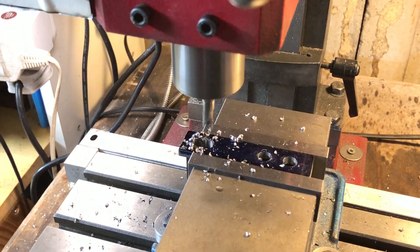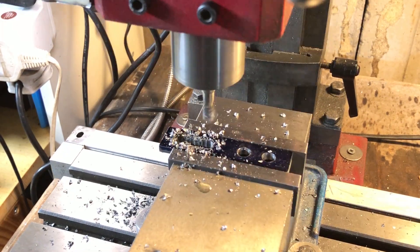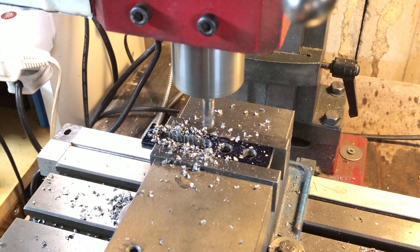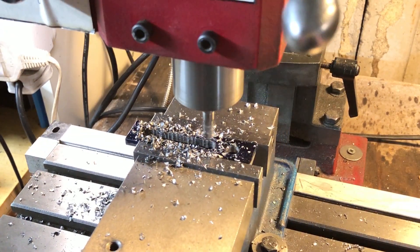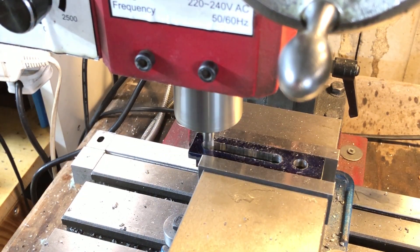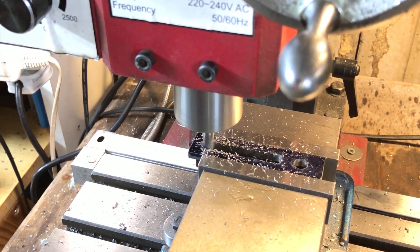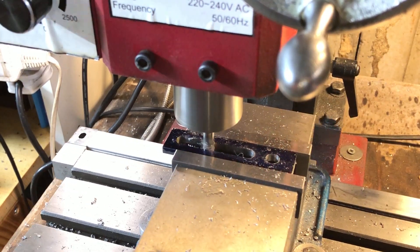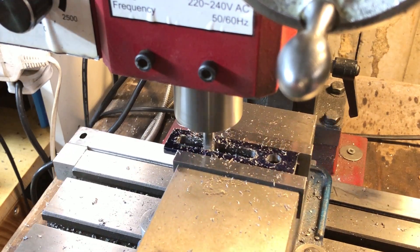With that done I can move on to the slot itself. I'm cutting this using a 9/32nd slot drill, and removing the majority of the material using plunge cuts. I find cutting at full width flexes the cutter or machine enough to move the slot off centre, so for me and with my equipment it is worth taking the time to open out to size. With most of the material removed I am then stepping equally in both directions taking the slot to dimension. Each pass I'm taking care to hit my numbers on the DRO which ensures I preserve the reamed reference faces on both ends.